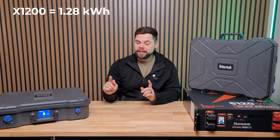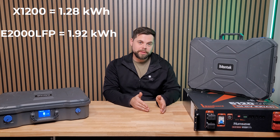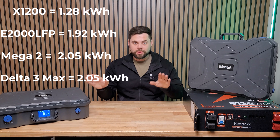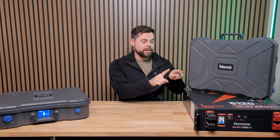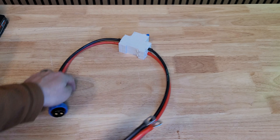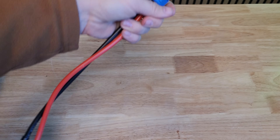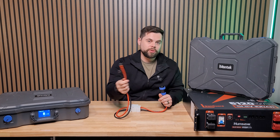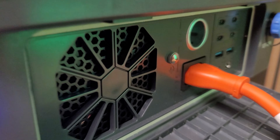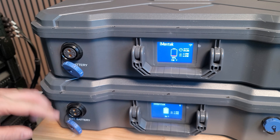The X1200 is somewhat lacking on battery capacity at only 1,280 watt-hours. The E2000 LFP is bigger at 1,920 watt-hours, and both the Mega 2 and the Delta 3 Max have 2,048 watt-hours. But in terms of battery expandability, none of them come close to the X1200, especially since you can use whatever 48-volt batteries you want externally — and they even include the adapter you need, with a breaker and battery terminal lugs that connect straight to a server battery. I was able to wall-charge both an X1200 and an external battery at the same time, with no sparks or issues even when one was at zero percent and the other at 100%.